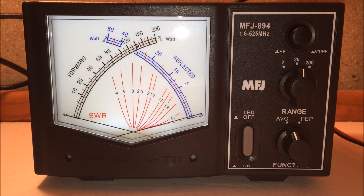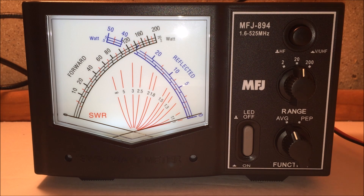Using a dummy load gives a perfectly matched load free of SWR issues and coax variables. For antenna tuning, SWR should ideally be tested at the feed point, though many people test at the end of their coax to see what the radio is seeing. This is a great piece of equipment and you'll see it in future videos — I have a 60-watt mobile I'll be making a video on. Thanks for watching, subscribe for more videos, and 73 from KJ4YZI.